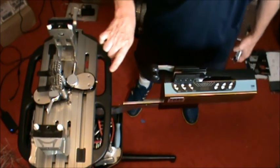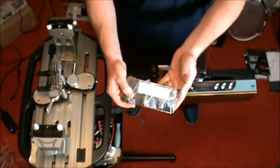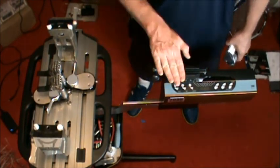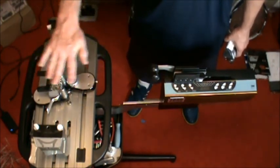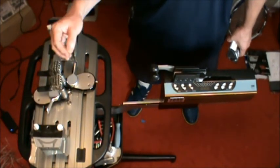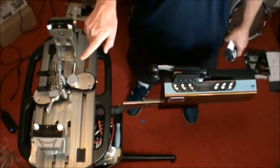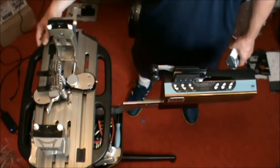So there's a slight angle down of the string on each pull. If you implement this, this is going to be 2 inches higher, and the pull will be almost parallel to the floor. It'll almost be on the same plane as the string bed itself. So you'll have a little less friction at the edge of the frame where the string enters and exits the grommets. But your tension head will be in the way, so when you pivot your turntable around, you'll have to